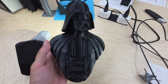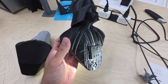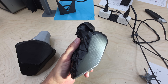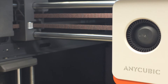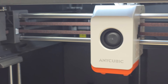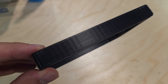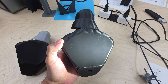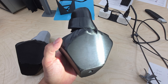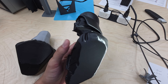I think the real winner of these tests is the surface smoothness of the prints. I printed a Vader statue on the S1 and the X1C to compare — the surface quality was better on the S1, but it was still plagued by the Z artifacts. The S1 comes with the same brand of belts as my Q1 Pros, which left residue on the pulleys after about 2,500 hours and impacted surface quality. The Q1 has a constant chamber temperature of 60°C and most likely degraded the belts faster. Since the S1 doesn't have a chamber heater, you may be okay, but I haven't had long-term testing to prove that. Regardless, the surface quality is the best I've ever seen out of the box, and its biggest downside is the Z artifacts.